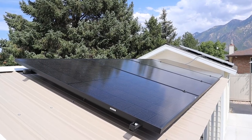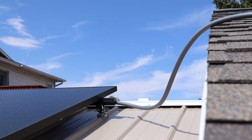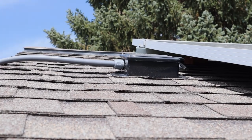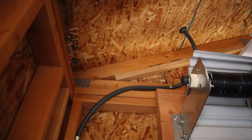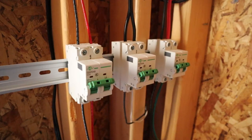The final part of the project was wiring the solar panels. These four solar panels are wired together in series. I then took the main power cables from the panels and routed them through liquid-tight non-metallic conduit to my existing junction box for my other solar array. The power wires are then routed into my shed where I have an inline DC circuit breaker installed. I can also use these DC breakers as solar disconnects to shut off the arrays if I need to work on the wiring.